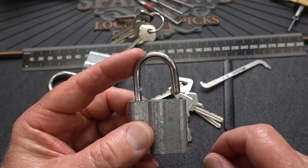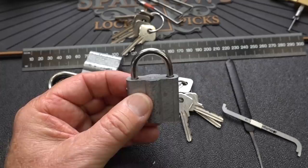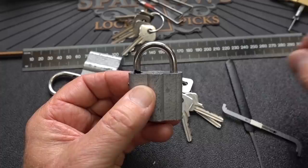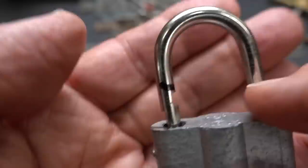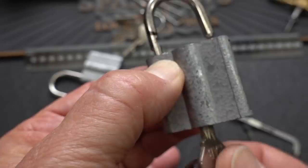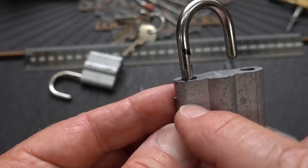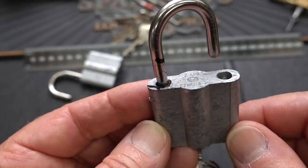So that lever turns in there — let's figure out where the lever is before we start cutting. Let's go ahead and lock this guy back up. I'm going to take a pen and mark the top of the shackle, then find the right key and open it back up. Notice that line is not a lot above, so that tells me the lever is barely below the body of the lock. The lever is literally right there and it's going to turn clockwise to lock. So if I machine off a good chunk right in here, we should be able to see exactly how that locking mechanism works. I've got two tries — let's see what happens.